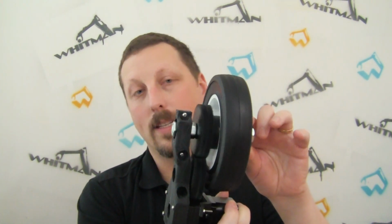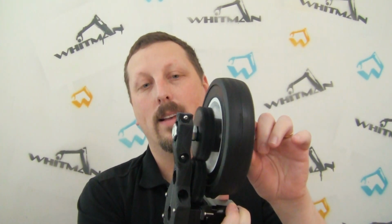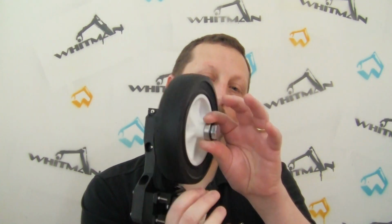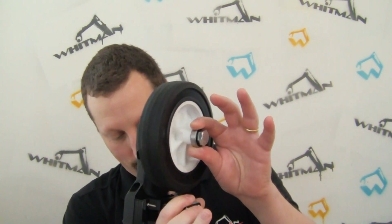So I actually have to redesign these brackets again and make them just a little bit farther apart so that the gears aren't being smashed into each other, and the fact that they're 3D printed so they're not dimensionally perfect, that wiggle room will account for that. But once we do that, we'll have an actual usable foot, and then I'll need to design for the back here.